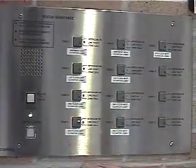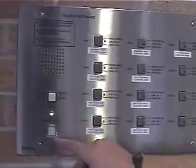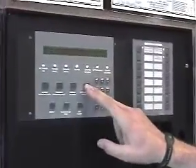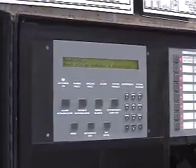Basically, there is a button that's pushed over there and it's going to come up over here. You hit the button corresponding with that and it will be beeping here too. Once you're done you can push this button, then reset the zones and it will all go back to normal. Also note that when you reset a fire alarm, the reset button needs to be held in for at least five seconds. Once the display says 'resetting,' you know you've reset the system.